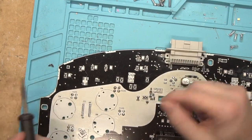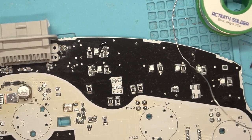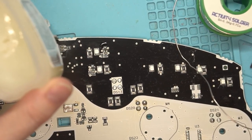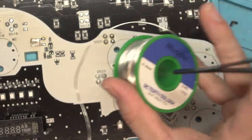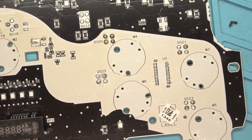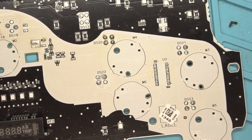They all have a good amount of flux. The Chip Quick is definitely the best. We can already make a perfectly fine solder joint from all of these — so we know it's gonna work, spoiler. Since we've already determined that all of our solder has flux in it, we're not going to add any fresh solder. We're just going to use what's left on the PCB. There should be enough to reflow it. We'll try each of our different materials first, then try with actual flux.